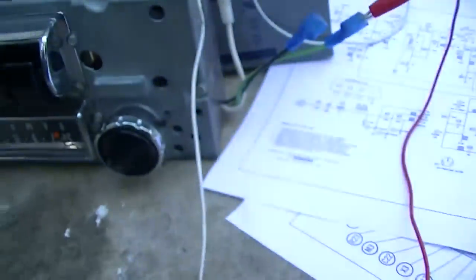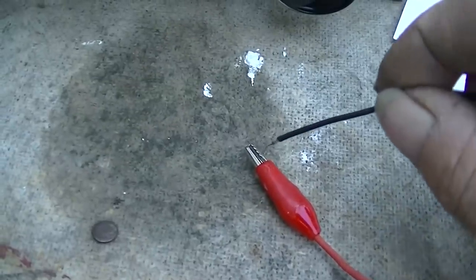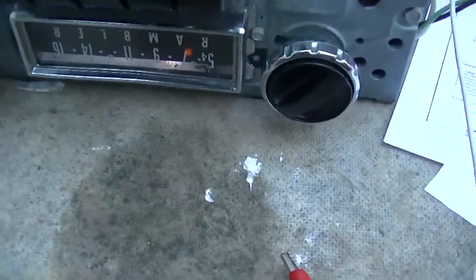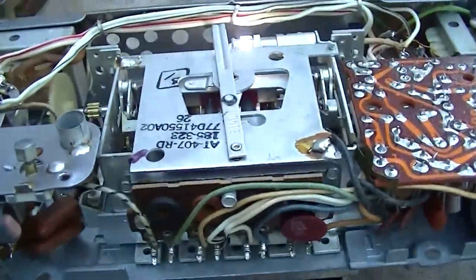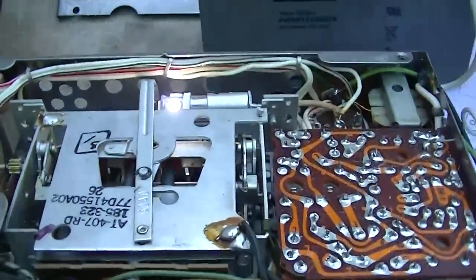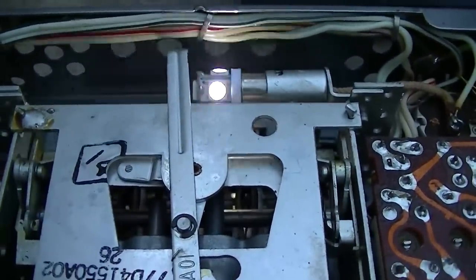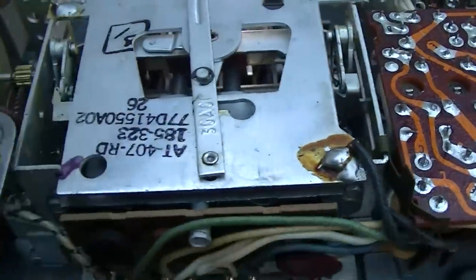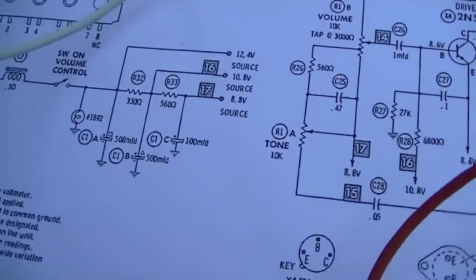Powered up and it is totally quiet. Let me check my connections real quick. You can hear when I connect there is some noise. There is one hell of a clunk in here when you power this up. That's not coming out of the speaker — that's coming out of something in the radio. So we know we should have our voltages on this capacitor — let's do a little diagnosis.